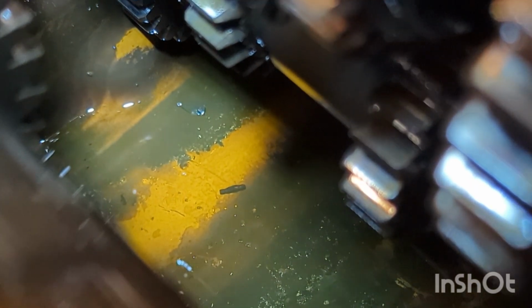But as you can see, it's the clutch system there. More than likely going to have to adjust these clutches. So you can see lots of metallic debris in the base of this gearbox, and sadly when you get a proper look, I don't know if you can work that out in the camera there, maybe it's not, there's what looks to be perhaps either a small pin, or I'm convinced there's a couple of them, so they may be little fragments of gear.